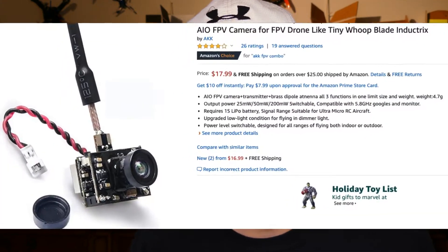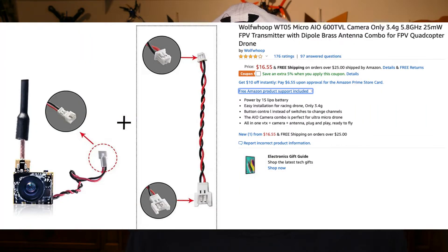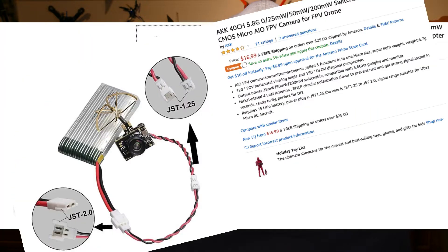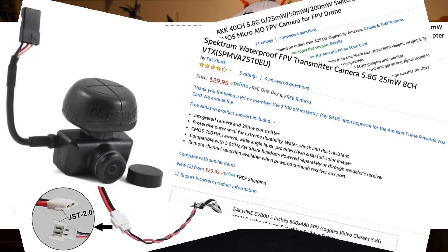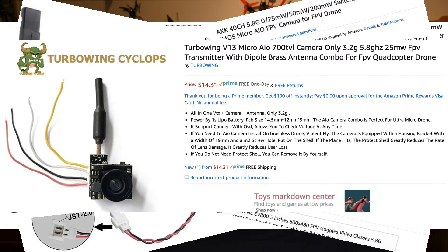Power connectors: typically, these connectors are intended to plug directly into a one-cell LiPo battery or into an airplane receiver for a constant 5-volt power. Some cameras may also come with adapters to fit different types of batteries or different servo connections. And some come with only bare wires — the downside is you have to solder, but with some basic skills and equipment you can add whatever kind of connector you need.